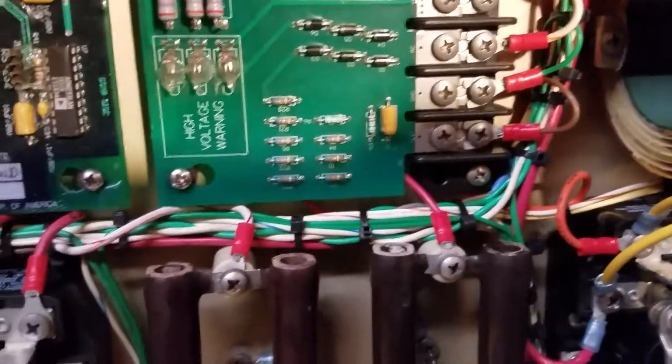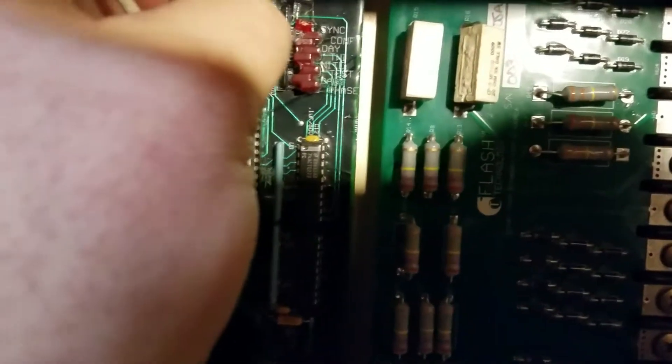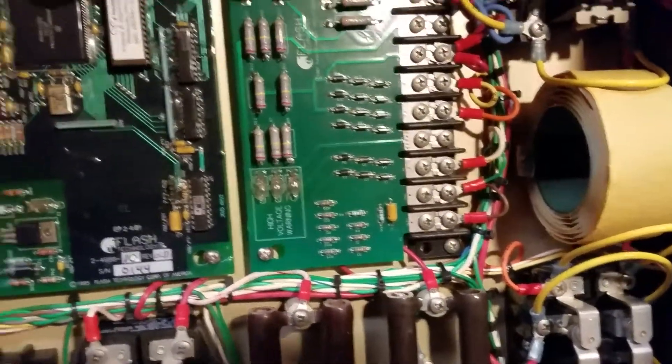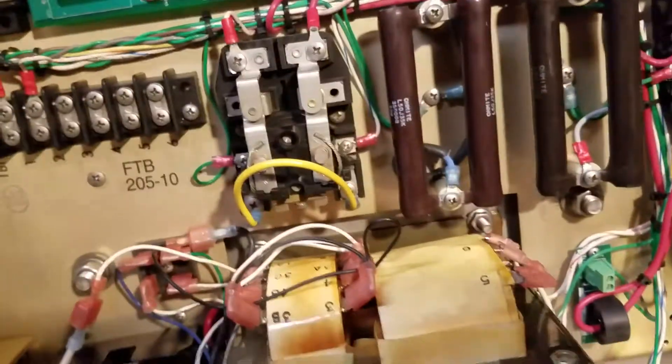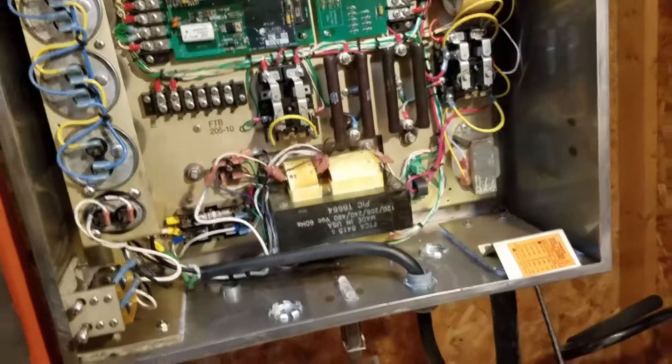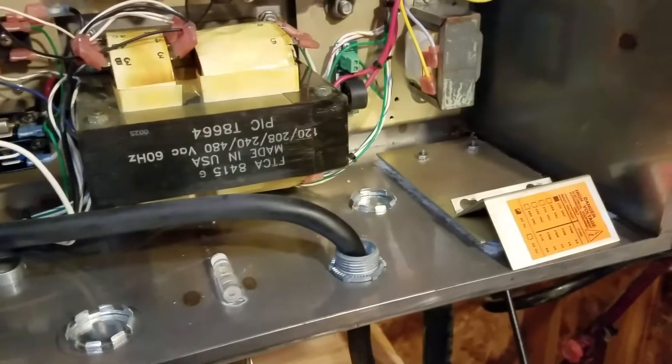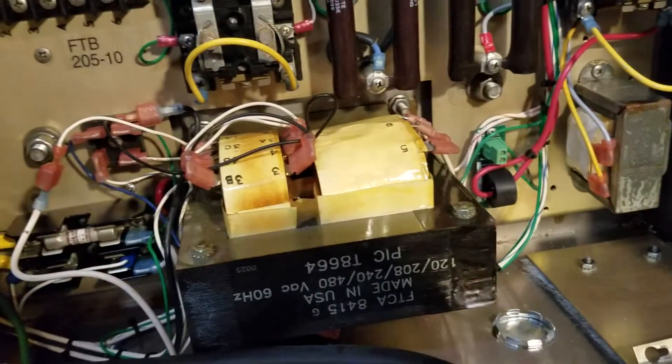I better wait for the high voltage to go out. I've already done it before when changing the intensities. We'll switch it to twilight. That's a 24-volt circuit right there that I'm completing, so I'm not really in any danger of electrocuting myself unless I touch anything on this board or any of the points here. This board is also covered in plastic — you can see it right there. One of my little LEDs snapped off for sync, and you can see the actual plastic sheeting right there. Twilight on my beacon is a little weird — the transformer actually starts making a weird humming sound, and I ran twilight for about five minutes one day and there was a burning smell. So we'll go ahead and fire it up — I don't run it too long in twilight anyway.